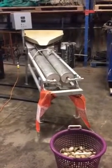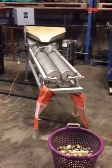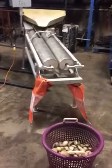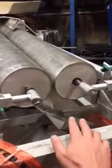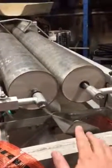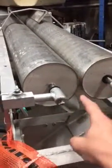I put two bags over the end. Now this is not hooked up to an air solenoid. If you hook it up to an air compressor, what will happen is at your count — let's just say you do a hundred count in a bag — after you reach a hundred, which is displayed right there, the air will pneumatically kick it over so all the product comes off of here.